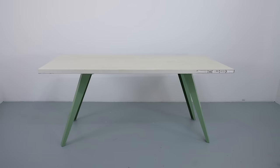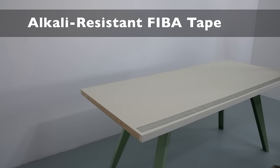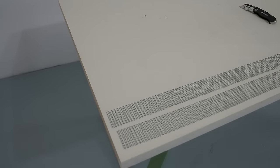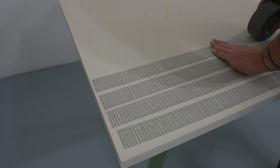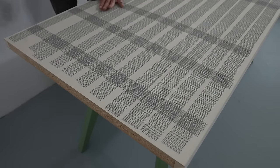I don't want the concrete to crack, and a quarter inch thick coat of concrete will definitely crack without reinforcement. So I picked up a roll of mesh fiber tape from Home Depot. I made sure to use the fiber tape that's meant for cement board because it's alkali resistant, unlike many of the fiberglass tapes that are used for gypsum board.